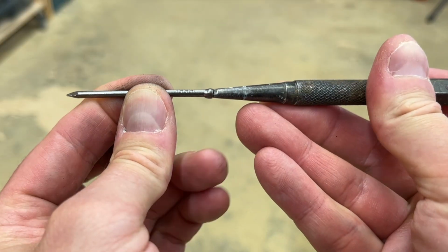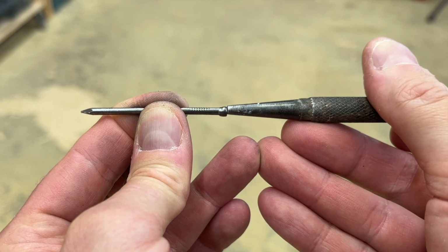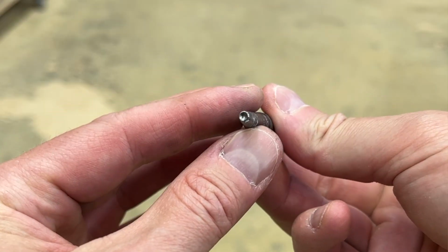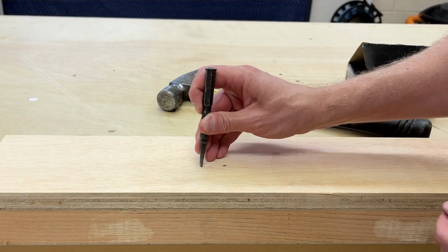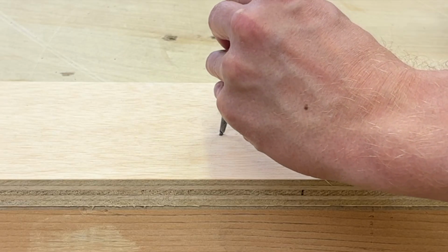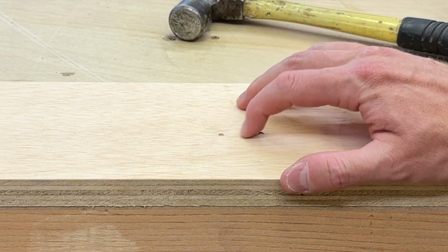However, if you use a wider nail set, it won't mate as perfectly with the larger trim nail because it can't fit in it or around it. But you'll notice that these larger nail sets actually have a pit of their own in the point. And this makes them much better for driving really skinny fasteners like brads and pin nails. The pit on the nail set fits over smaller brad heads, locking onto them. Now you can drive your brad in cleanly, leaving only one small circular crater. This is why nail sets come in pairs or trios, and why you really want to try to keep a couple on hand if possible.